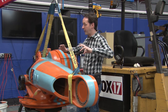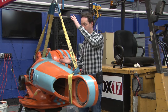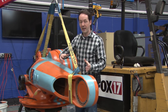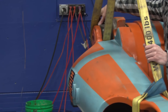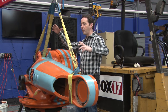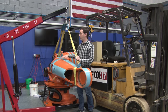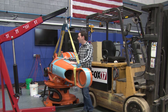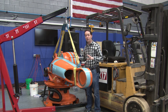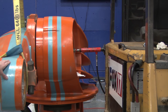We don't really know what it's going to want to do when it comes out. We know this end of the arm is heavier, and we know the gearbox mounts in here and it's going to be attached to the arm — so when it comes out, it's going to want to spin this way and rotate this way. The gearbox is a concentrated weight; the bare arm is just one big solid aluminum casting. Because we know it's going to twist and rotate, we've made sure to grab it with separate straps. We're lifting this with our big AFF engine hoist, which can easily handle the weight.